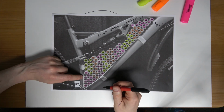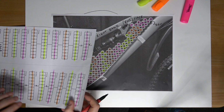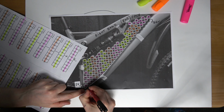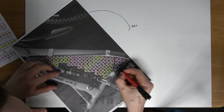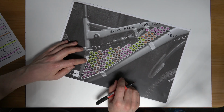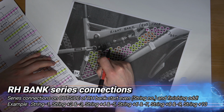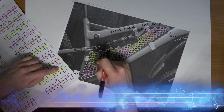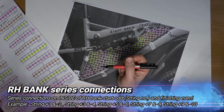Okay, here we go. So remember, this 0 volts is connected to this point. Here we will have 10 cells in parallel. I'll try and do this nice and neat here. So that's one copper bus bar. The next one now will be second string to third string connected together. At this side it will be second string connected to the third string. At the other side of this pack, on the other image, we will have the first string connected to the second string. So that makes sense.